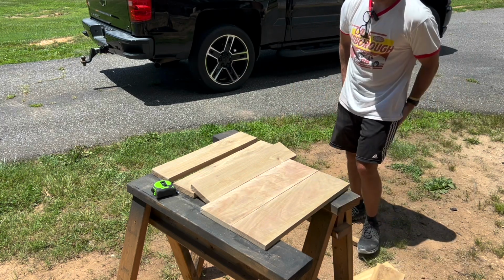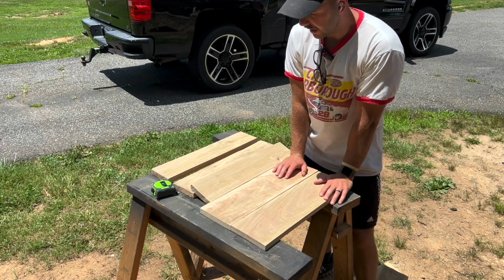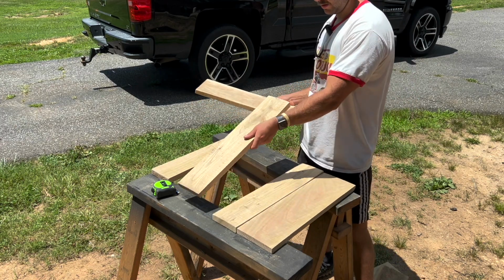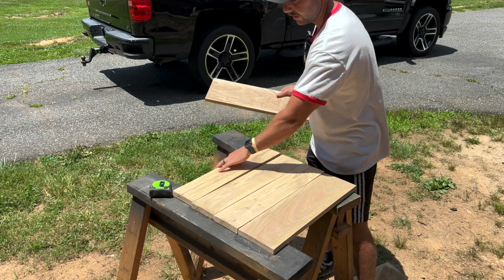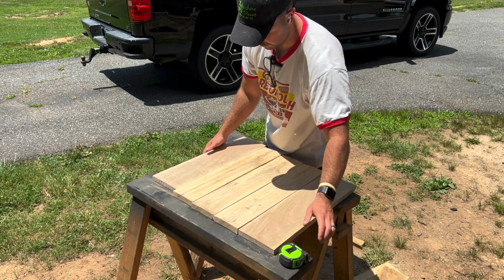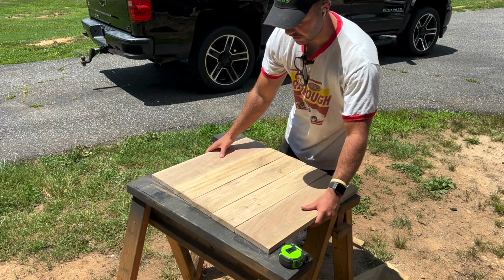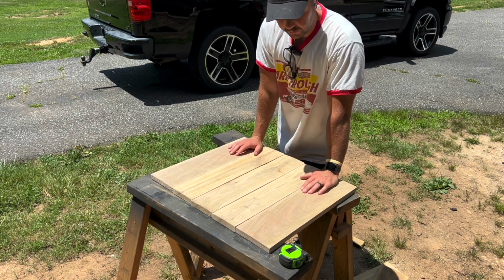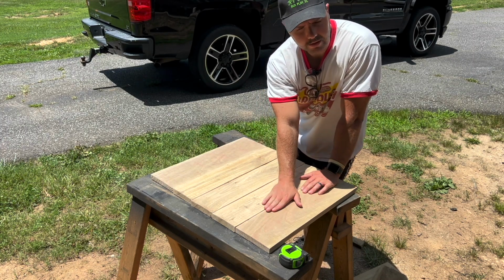So my goal now is, like I said, to get the best orientation that I can with these. I might put these bigger pieces on the outside, with everything trying to crown in a similar direction. Again, this is not going to be a perfect thing because it was never intended to be. I'll try to pocket hole them together, and I might flip them around and do it from the other side, but hopefully I can get the tops relatively similar.